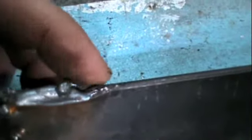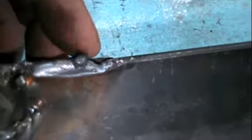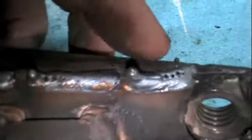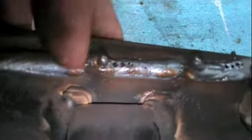Here is where I tried the anti-splatter spray. As I do a little weld, it would just bubble and splatter. As I stop welding, it would boil up. If I grind that off, I find little voids — bubbles, air pockets inside. You can see them right here on the finger. Here's air pockets in the weld, a bubble, air pockets, a bubble.